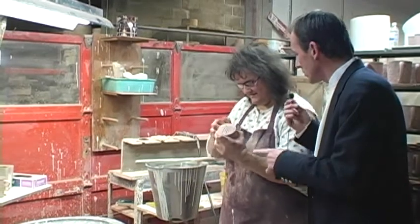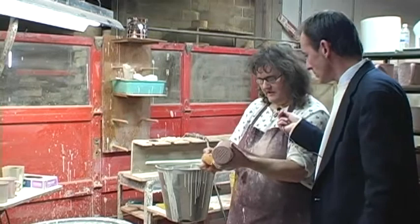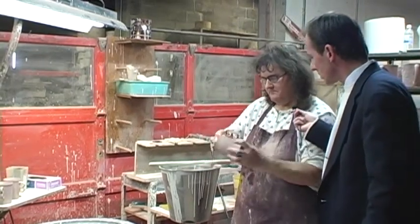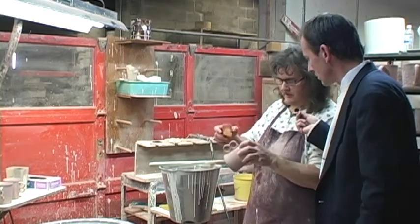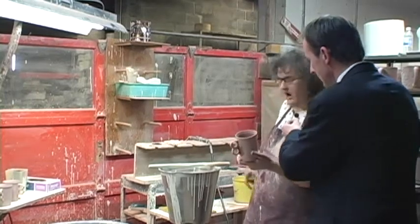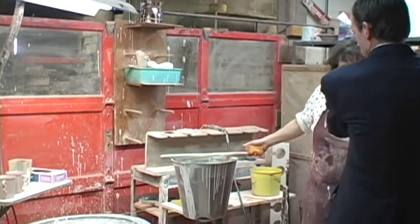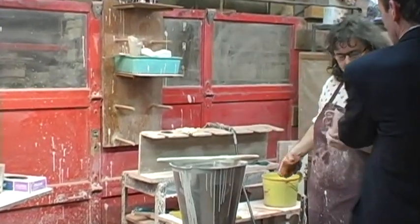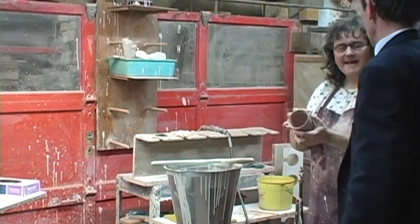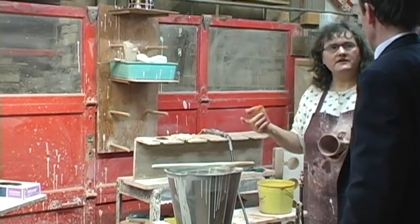Karen, now you are doing what's called glazing? Yes. What I'm going to do is dip and slush it. It's a procedure that we do that leaves no fingerprints on it. I clean my cup up, and it's usually for just cups, small items. I'll blow the dust off it. I have put it on my vacuum, which is a little bit loud, and I'll dip it in. When I pull it back up, I step on my pedal, and that'll force glaze onto the inside, and it's all done in one step. It'll dry very quickly. You'll be able to see it.